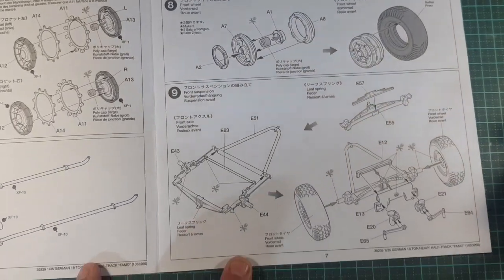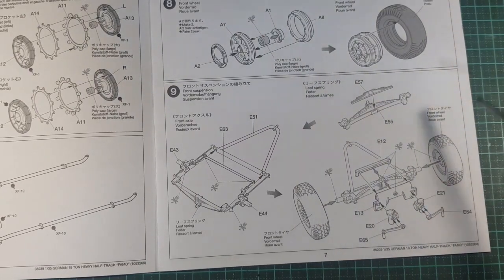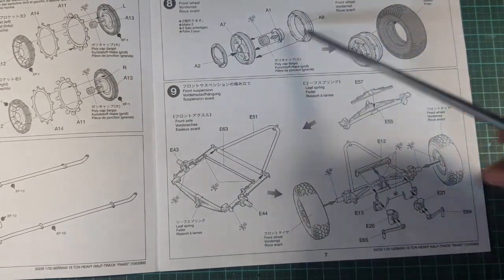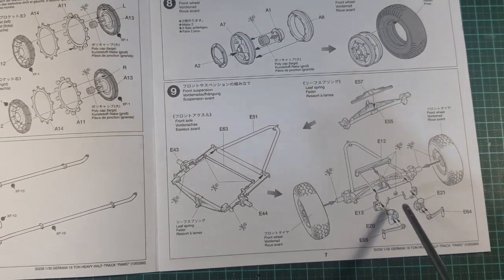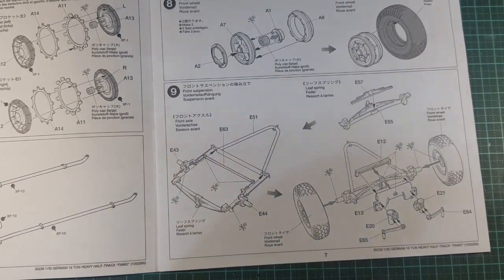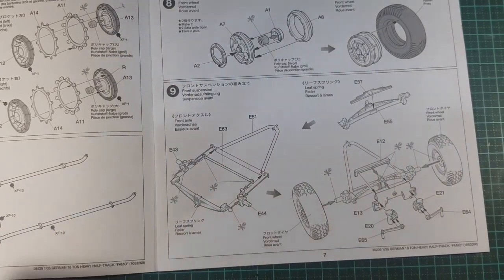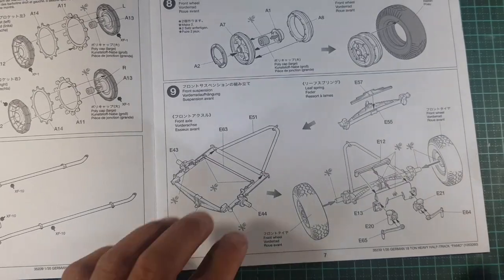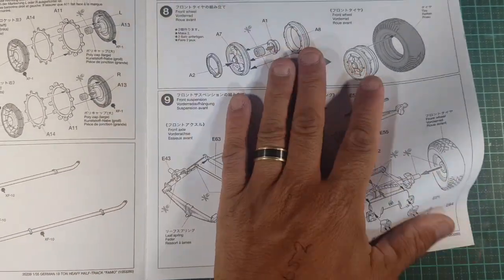Step 9 is front suspension. You've got the front axle, leaf springs, the front wheels going on. So you would have assembled those two in step 8. And all down here, you've got your steering mechanism. So be very careful with glue, because this is going to be a movable part. Just be very careful and very light with your glue application.